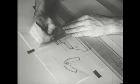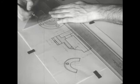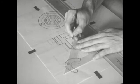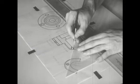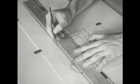Vertical hidden straight lines follow horizontal hidden straight lines and are drawn with a ruling pen, triangle, and T-square. Inclined hidden straight lines follow vertical hidden straight lines. Horizontal auxiliary straight lines follow inclined hidden straight lines, including the short horizontal segment at the beginning of each leader. Auxiliary lines comprise extension lines, center lines, dimension lines, section lines, and leaders.